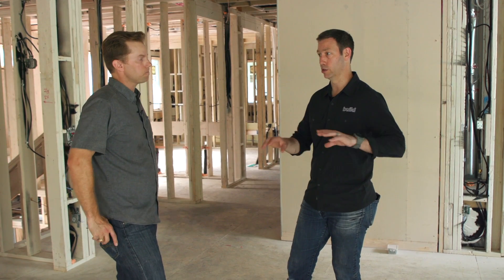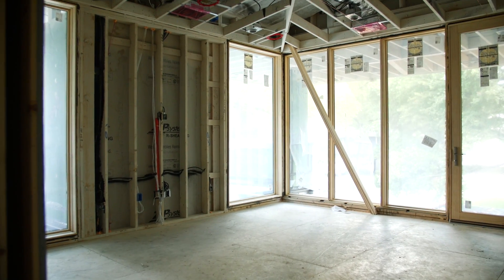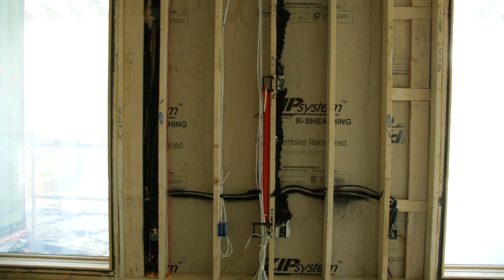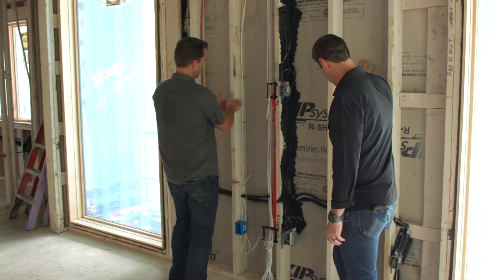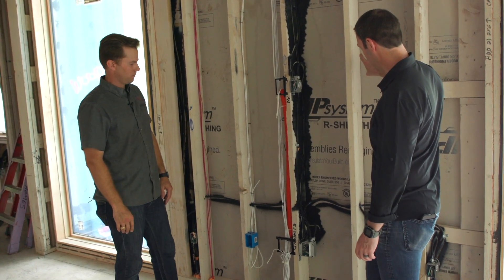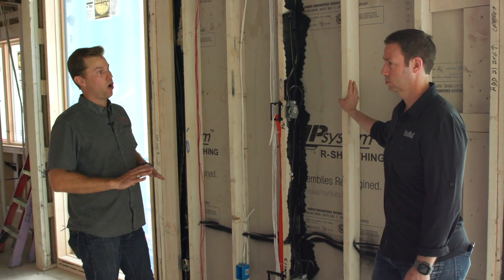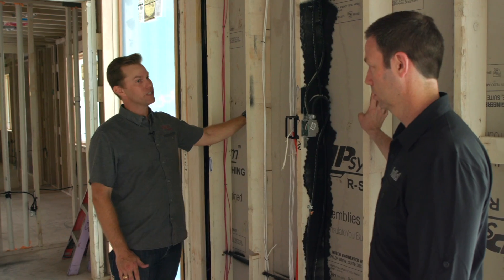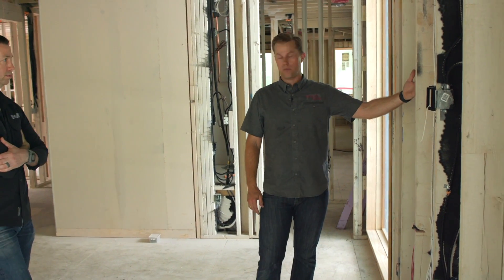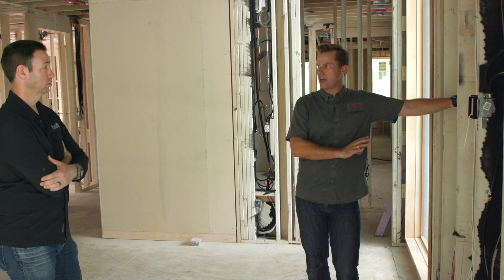On the theme of foam-free, your stud bays are empty, but I notice you've got Zip-R sheathing on the wall. I love that thermal bridge gap. If we can wrap our homes in a sweater instead of stuffing it in the ribs, we're always off to a good start. We increased by 50% the R-value of this section of the wall — went from R-5 to R-8.3. No T-studs on this house. The consultant was okay using Zip-R because we're ventilating our stucco, and because it's mixed in a factory with safer controls, he was comfortable that it's already off-gassed and okay to put in a home.